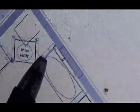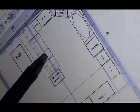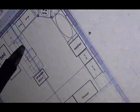But the tub needs to be close, or the tub needs to be raised up to get slope on the drain. Here's where the floor drain is — kind of the general wet area: sink, sink, tub. Here's the drain, kind of flowing into this floor drain that's in the concrete floor. I don't want to be walking on all this miss-sloped stuff, so I put a counter over that sloping area — most of the slope will be covered by this counter, so I won't really be feeling it.